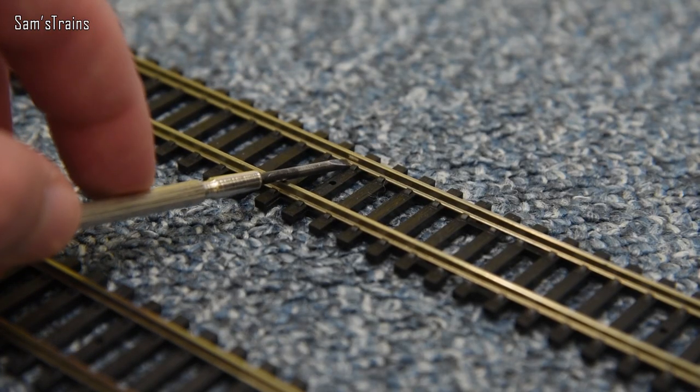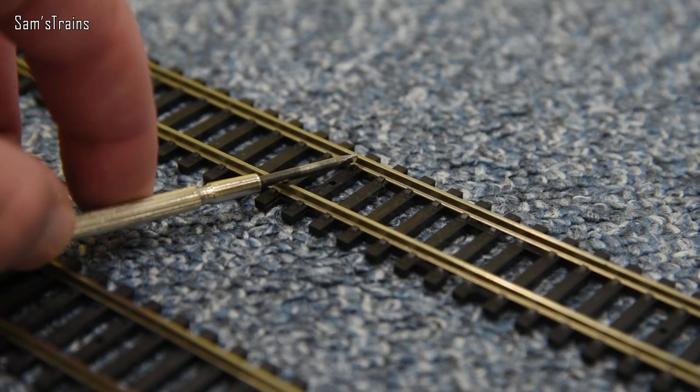First of all, what is a short-circuit? For that I need a screwdriver — here it is. A short-circuit occurs when a load of very low resistance is placed across a circuit, and that's where the screwdriver comes in. If you put a screwdriver across the two train tracks of your model railway, you will be shorting out your controller. On a controller without any short-circuit protection, the full power of that controller will run through the screwdriver, stressing the controller, putting components under load, getting them hot — sometimes they'll overheat and burn out. When that happens, no more controller.